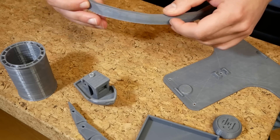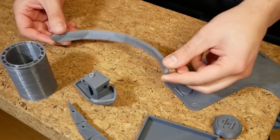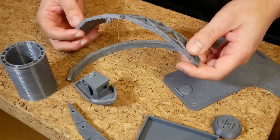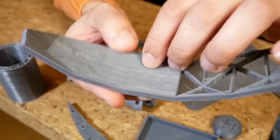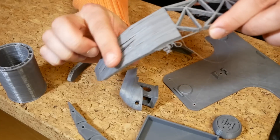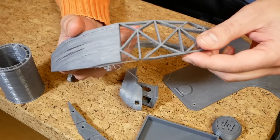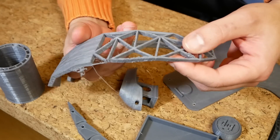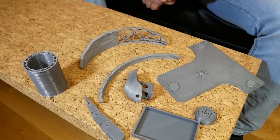After that I started printing with the glass bed, and that has a few problems — I haven't been able to get it to stick properly. The surface finish of the glass is way better than the masking tape, but halfway through printing one part it got dislodged and made a big rat's nest, so that was a failed attempt. I tried some more spray and printed another part, but there are loads of errors on it. I used the wrong infill settings — it's very lightly filled on one side and supposed to be solid. It got dislodged again and didn't manage to finish the print — it was rattling all over the place.